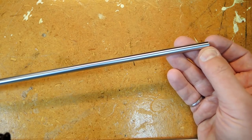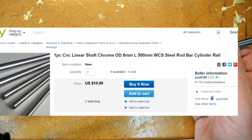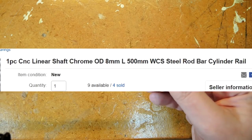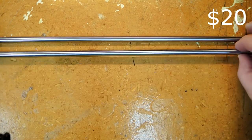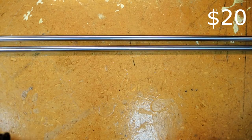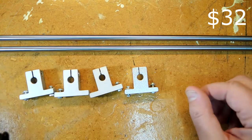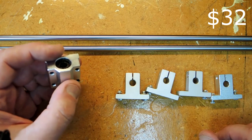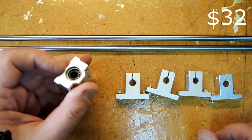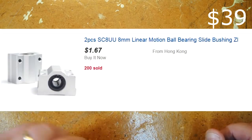As we'll see in a minute, that didn't quite work out. But the building block is this linear shaft guide rod — it's 8mm in diameter and half a meter long. I bought two pieces; it cost me $10 with free shipping from China. The rods need to be held somehow, and that's where the linear shaft guide supports come in — those set me back $12, another eBay purchase and very readily available. And then some linear bearings — this is the ubiquitous SC8UU, a very easily purchased bearing.